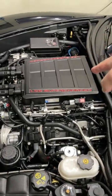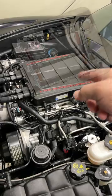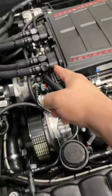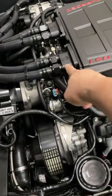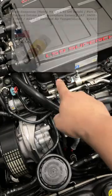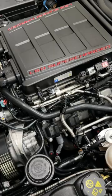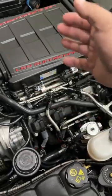I'll start at the top. The supercharger lid is factory but has been powder coated. I do have upgraded bricks inside by CNR Racing. Upgraded water manifold inlets by Synergy of Rick Hollenbeck — these are true three-quarter inlets. There's also an IAT-2 sensor, my secondary one, which communicates to my pump in the back for the rear tank and tells it to speed up or slow down depending upon the temperature inside the lid.